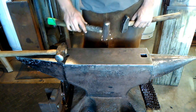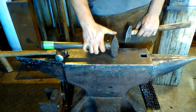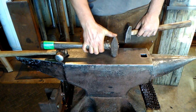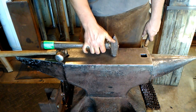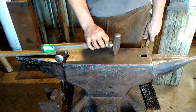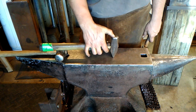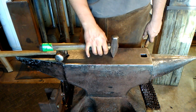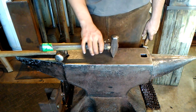Then I have another one with an even thinner radius to the peen. I use this for texturing operations mainly, as it's too choppy to do much good work with otherwise. I also use the other end of this hammer, which I've shaped up much like a big broad ball peen, to do some texturing work and to form steel bowls in a swage block.